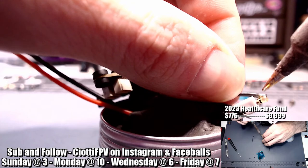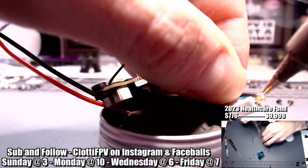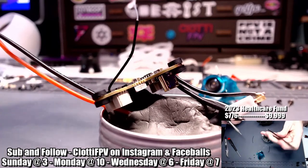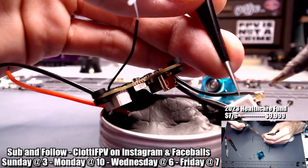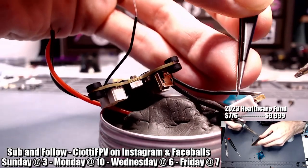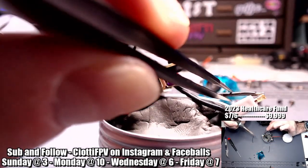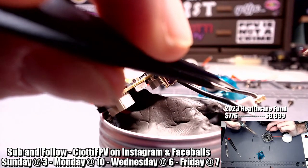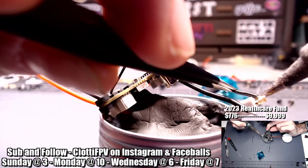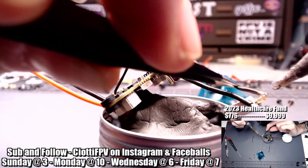Let's bring the soldering iron in at an angle here, so that as it pushes it downwards. It keeps wanting to shift up high. I'm going to have to do this with tweezers. My fingers are just too fat. This is hard to do. I got to be honest, putting this on at a 45 degree angle like this is tough. It's totally doable. You just might need to rework it a couple times. And don't stay on it for too long. Don't overheat it. There we go. Shit, it keeps coming up.